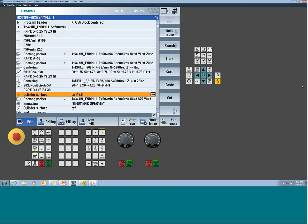Just remember, once you instate TRACYL or cylinder surface transformation, any Y motion is going to induce an A-axis move. You can't move the Y anymore. It's staged, or whatever axis it's rotating about. In our machine, it was about the Y. Had we had the B axis one, that would be a little different, right? Well, it's actually rotating about the X, technically.